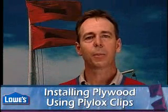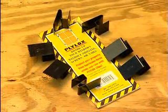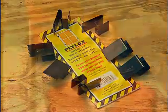The easiest window boarding projects are those that allow the window opening to be covered with plywood when a hurricane approaches. To help ease the process and to cut time, there's a product available that can make boarding easier and more effective: Plylox window clips. This process has no drilling. Clips create rigid, safe, temporary attachment of board to brick, wood, or concrete window casings. No nails, screws, bolts, or brackets will permanently damage your property.